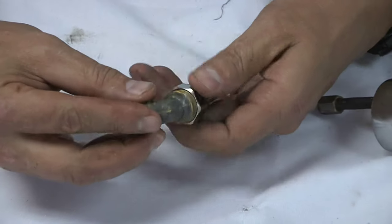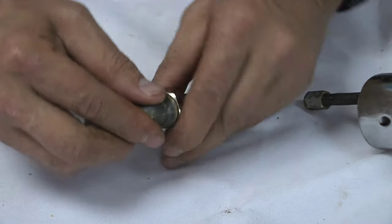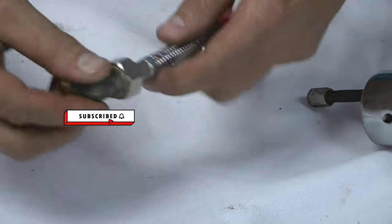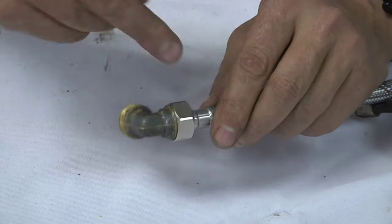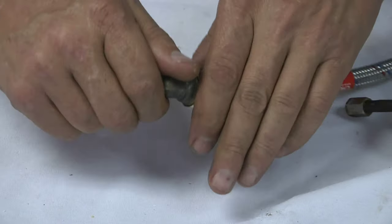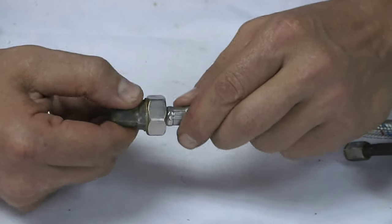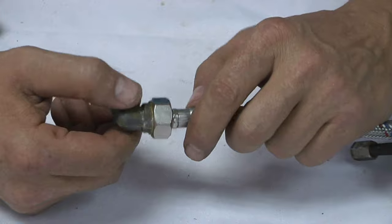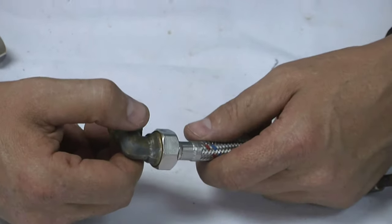All that you would do is tighten this flexi connector like that, and just twist it with your hand. You would immediately feel if it's tight, because if it's got any play, it means you would have to tighten it. As soon as there's no play, just with my hand, you don't even really need any tools to do this job unless it's really old fittings. But you can see there's no movement, and that's how to install a flexi connector. It's the easiest thing to do in plumbing. So go ahead and repair your own flexi connectors. I'll see you in the next module.